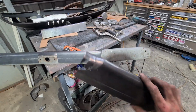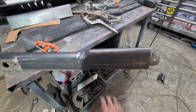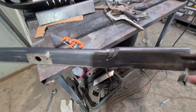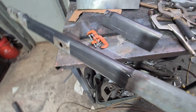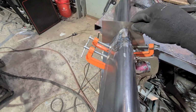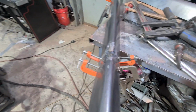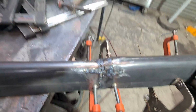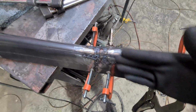I've started the sides, just cut for the shrinks, and it seems to be working. Just got to shrink the edges of this side to give it that arc, but it might work out here. Put some tic tacs on there this morning. Shape is still good. Just blaze out a little on the ends here. Just got to swash those in a touch. Bigger gaps than I'd like, but whatever. It should still work. It's nice and tight. At least it lets me see that it's resting on the bar properly, and it is going in.